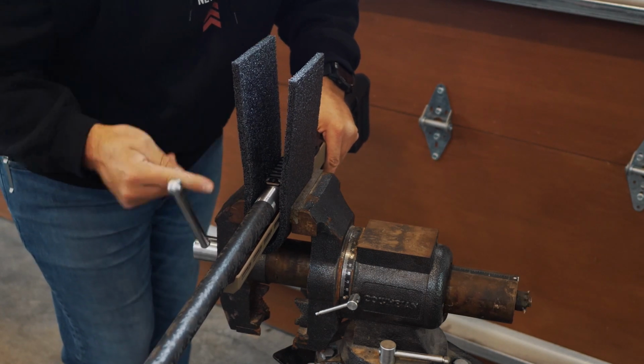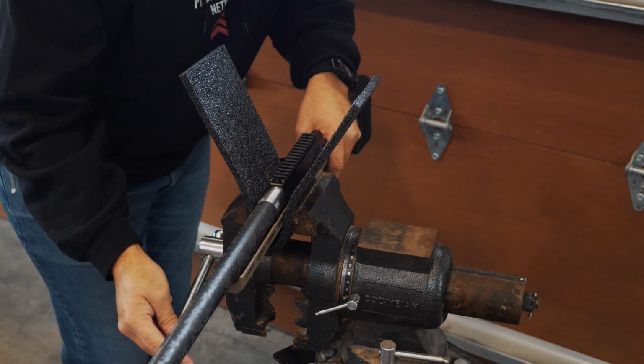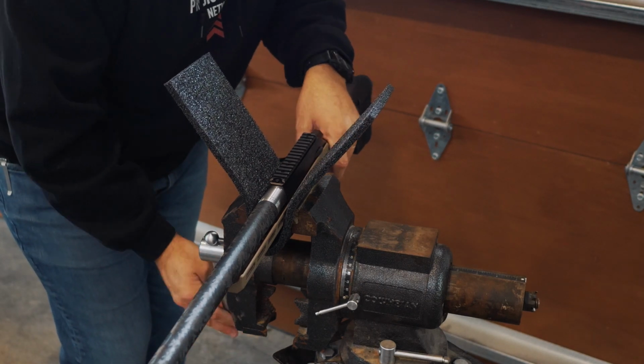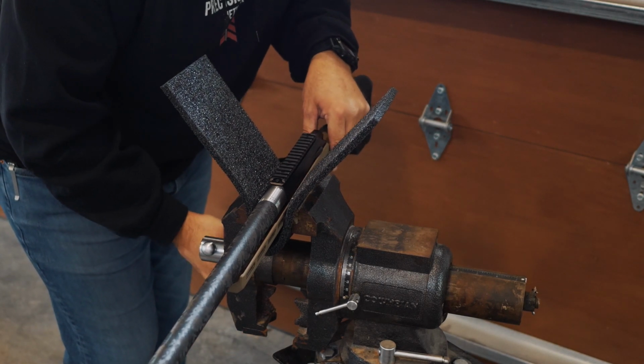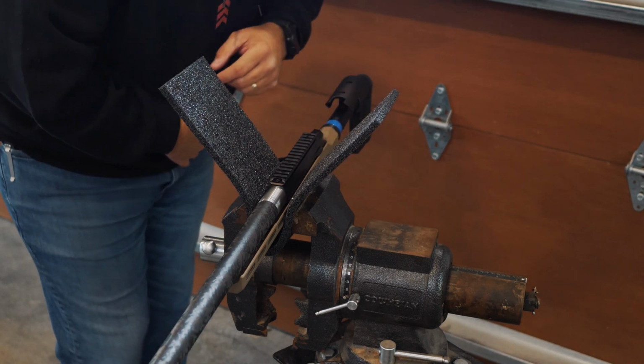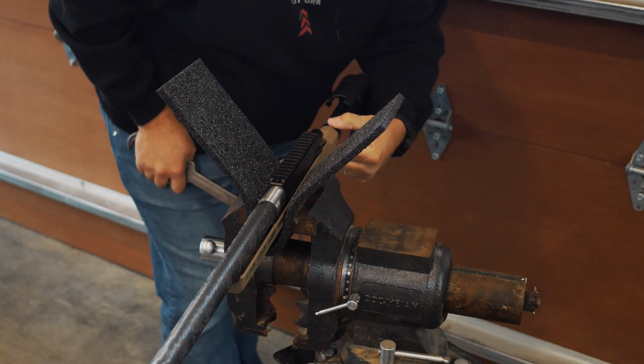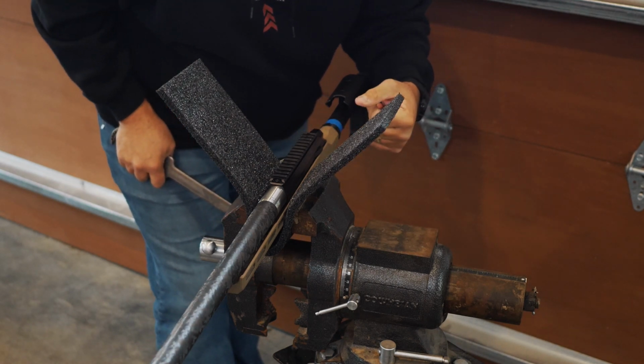I'm not much of a rifle builder, guys. You have probably realized that. And it doesn't need to be cranked in there hard. I'm not putting hardly any pressure on that thing at all. It really is just to keep it from twisting as I tighten the castle nut. Just hand tight. You do not need to crush this thing down. So that finishes up with that.